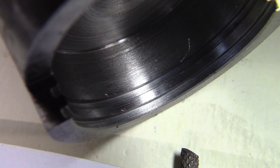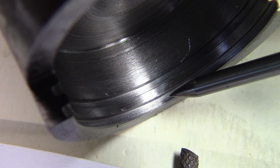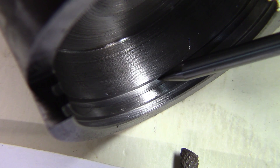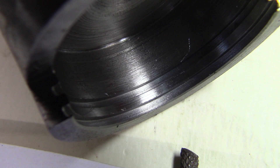We're getting a pretty extreme close-up here, which is nice. The first groove — the one that was singing — we can clearly see the singing marks in there: the little bands from the oscillation. That's exactly what it does. And we see the second groove, which is very clean, very nice, and very regular. The sides are nice, the bottom is nice, and even the corners are very clean. I just lightly deburred the edge; it would need a little more deburring if you put O-rings in there, since you don't want anything too sharp in that corner.